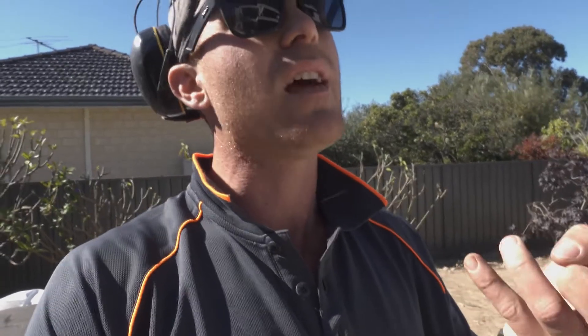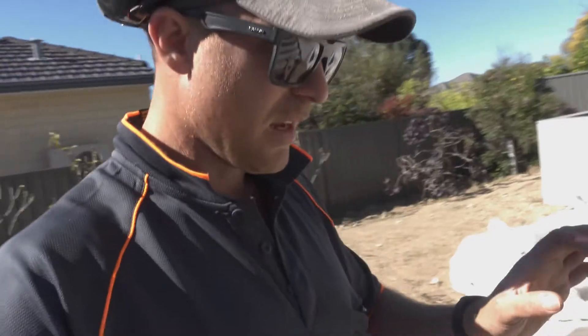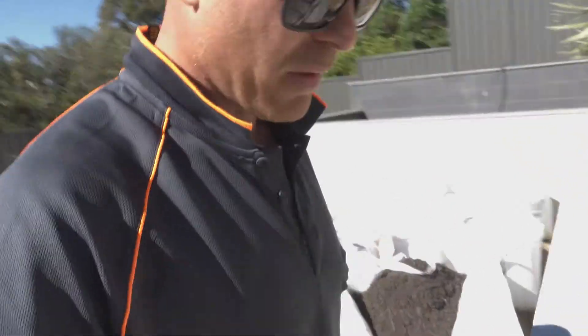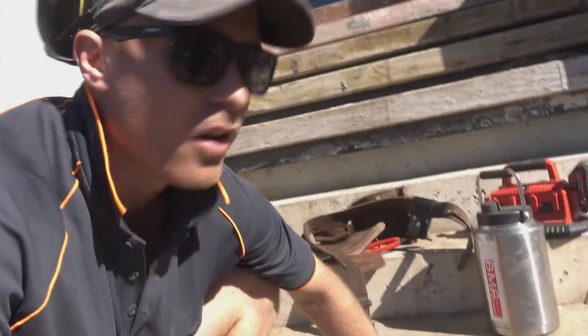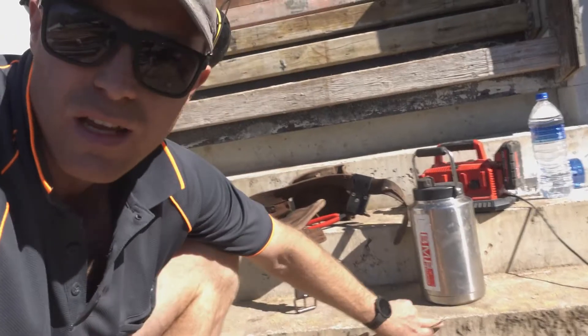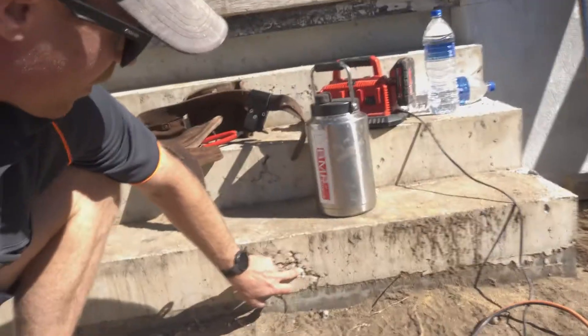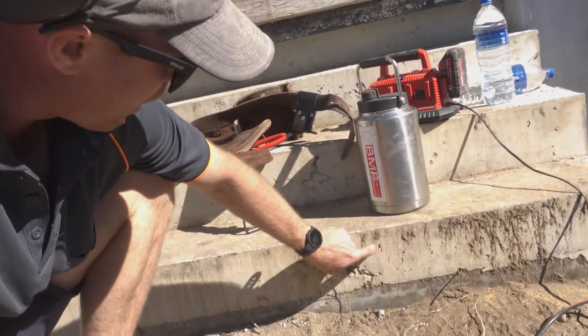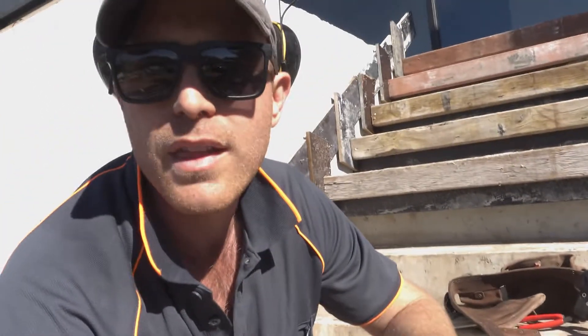With formwork, when you've got a gap, it's not about the concrete coming out — it's about the water. When the water comes out it separates. You end up with what I call boniness, where the water has come out along with some of the cement, and you end up seeing a bit of a crappy finish. There's some honeycomb up here, which is caused by not enough vibration. But on a joint of ply, if you have a gap, you get a similar thing — the water seeps through, the top layer of cement goes with it, and you end up with the stone exposed. So on neat stuff like this we don't want that. The way to avoid it is just make sure your formwork is waterproof, watertight, no leakage, no boniness.